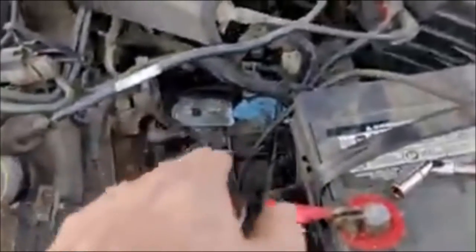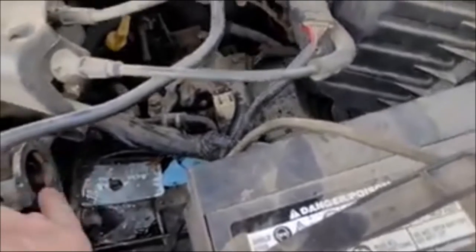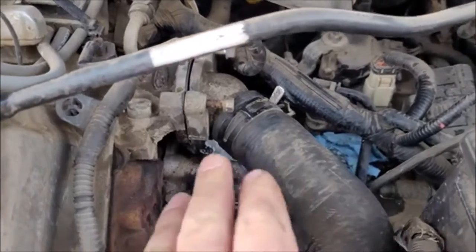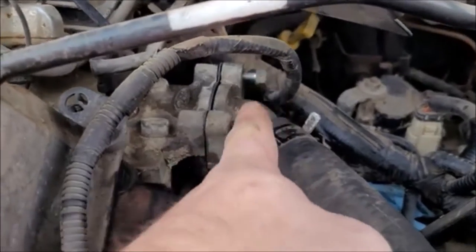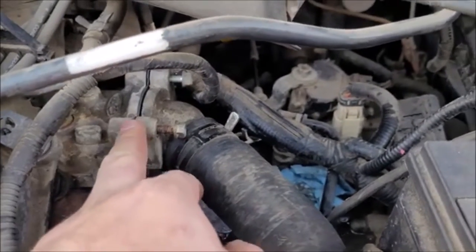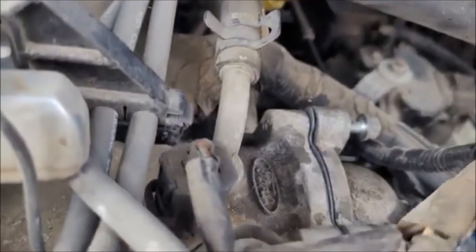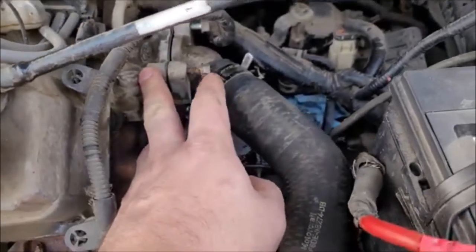Because I've only got one hand to do this, I'm going to have to do it off camera, but you just bolt it back up to these three bolts. Make sure this surface is also clean and that you're not leaving any debris inside. When putting this back together, one tip is to put the screws in loosely — put that one in first, then this one, then the bottom one — so you can make sure everything's aligned before you tighten it up. All three bolts are the same length and come all the way through, so you don't have to worry about which one goes where.